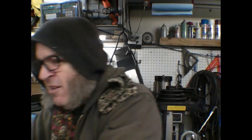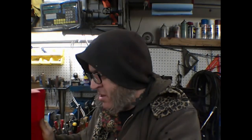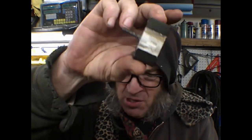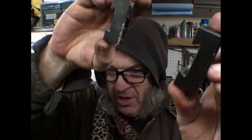And I'm just going to take a second and show these. These are the pin gauges, or what I used to get the initial measurement on the width, thanks to a whole lot of YouTube research. I suppose if I was making brand new dovetails, that information would have been more useful, but I'm not. I'm refurbishing the QCTP, which are these guys, and you can see the fresh machining on them, to mate with the OXA.